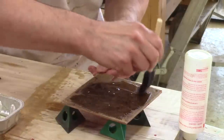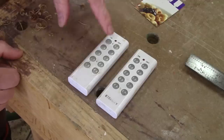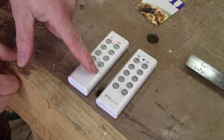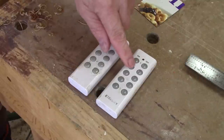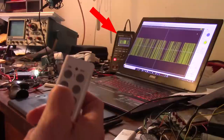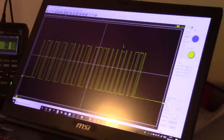While all this dries, I'm going to talk a bit about the electronic part of this project. I start and stop my dust collector and radio with a receiver like this one. Both of my remotes don't work as they used to — almost all the push buttons don't work anymore. I always need to have both of them at hand. I even had to reprogram the receivers so they would still work. So, using my numeric oscilloscope, I was able to record the codes of my transmitters. With this, I'm able to reproduce all of them.